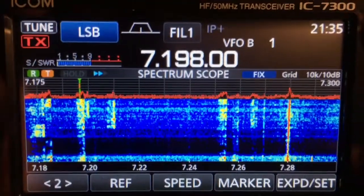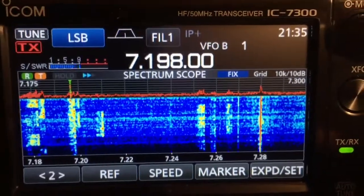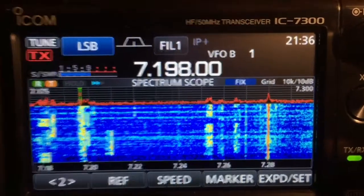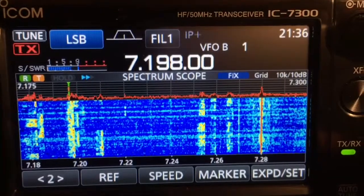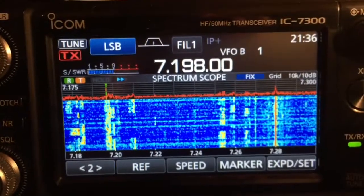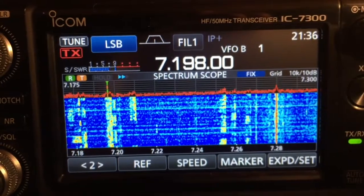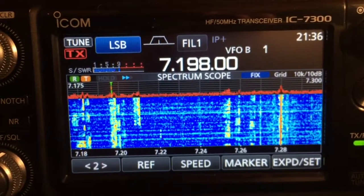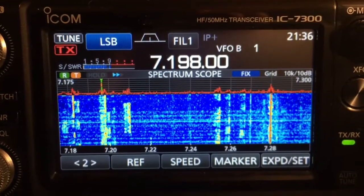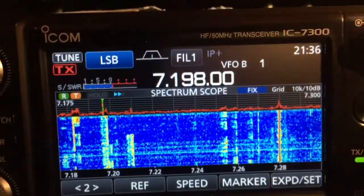It's got a beautiful display. I think for newer hams, or any ham for that matter, you'll be very pleased with this radio. At first I worried about the screen size — maybe it might be too small compared to some of the more expensive radios — but for the price you get a lot of radio for the money. It comes with a built-in automatic tuner that can tune up SWRs up to 3:1, and in emergency mode can tune SWRs up to 10:1, which some other radios don't do.